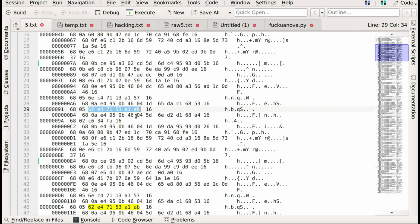So what I did was I got out some common CRCs and checksum algorithms, and I tried to see if I could match the packet up to the checksum. I took it from the beginning of the packet including the header, the beginning not including the header, the beginning not including the instruction or the type of the packet, and none of them matched any standard checksum or CRC protocol. Whether they were 8 bits, 16 bits, 32 bits, I couldn't match any of them.